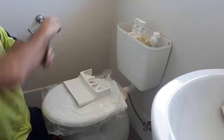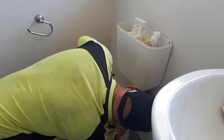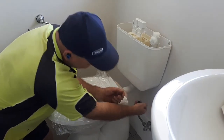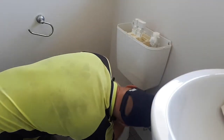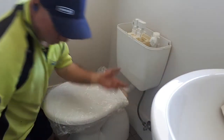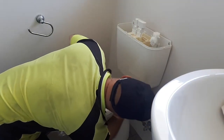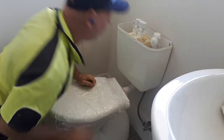Now if you really want to, put all this back together and put the water on. Now here's another thing guys — these flexi hoses. I see this quite often. They've got rubbers inside, and so often I see people down here on the isolation valve threading tape on it, and then threading tape on the thread on the inlet valve and stuff like that. Don't do it. You don't need to. That's what the rubber's for. When you want to change the fill valve later, you've got to rip the flexi hoses off and then you've got to struggle trying to get this thing up underneath there over the thread tape you just put on. Trust me, you'll get sick of it and you'll probably end up changing the whole new system out.